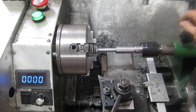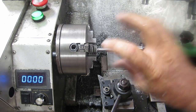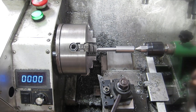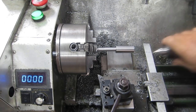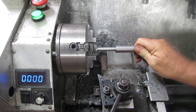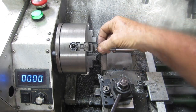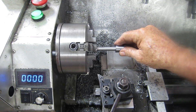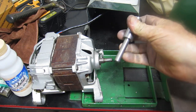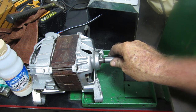I hate to admit it, but I've had to remake this part because the other one was rubbish. I made it round the other way this time so I could make it all in one setup. The good news is when I reamed this one it came out really nice — that's an awesome fit up in there. Beautiful. No wobbling this time. I haven't polished it up yet because I want to check it on that roller before I do anything else. After a little bit of a polish up — fits nice on there, fits really nice on here.